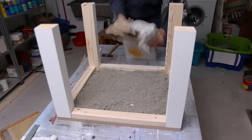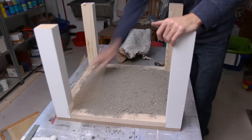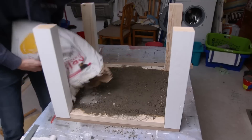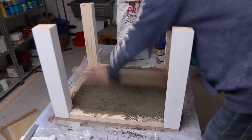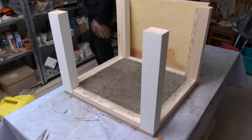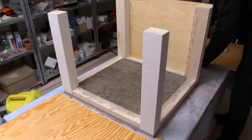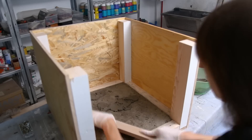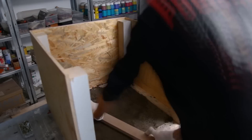I chose the latter, and as you can see in this footage, this is not a tutorial on how to make a concrete slab — if anything it's a tutorial on how not to make one. I tried to follow the instructions on the concrete I had laying around but it wasn't really designed for applications like this. The top ended up really rough because a bunch of it didn't stick properly, so I went back in with only the fine stuff after filtering out the big gravel pieces. If I do it again I would buy proper fine concrete and mix it properly before pouring.